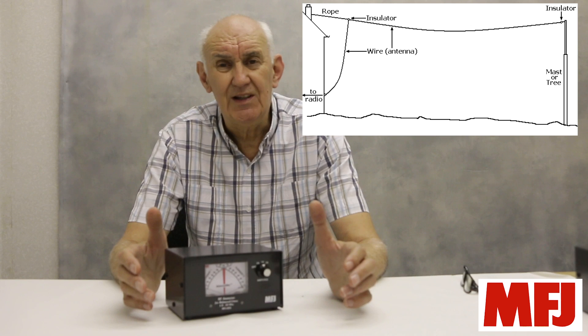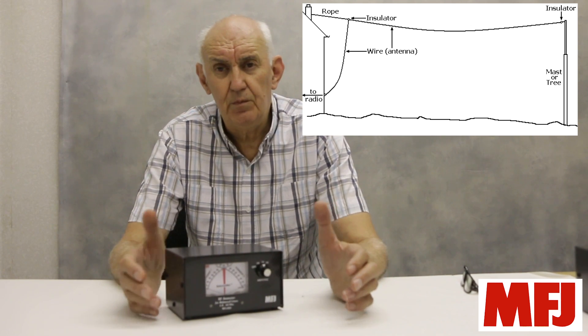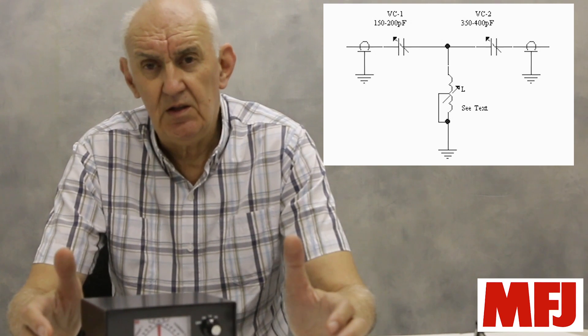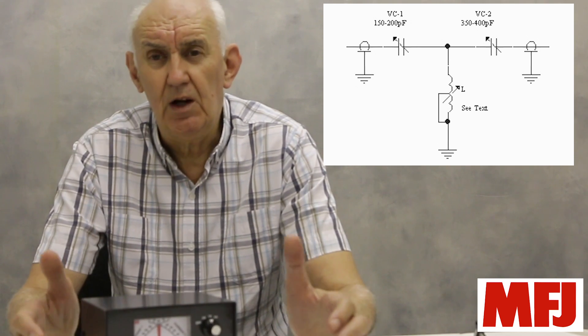The whole tuning process becomes a lot easier and a lot more intuitive. In most cases you can say that maximum current flowing through the coax is going to be the best match for your antenna system, and that applies both to coax-fed systems and also to end-fed wires. It particularly applies to end-fed wires where an ATU is absolutely essential. You can find several points that will give you a good match — you've usually got C1, C2, and an inductor — and you can find several combinations where you get low SWR, but there's only one combination which provides the greatest efficiency. That greatest efficiency is achieved by monitoring the antenna current.